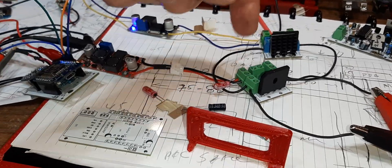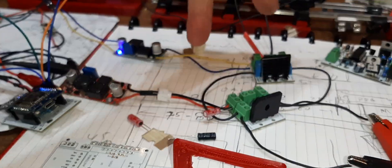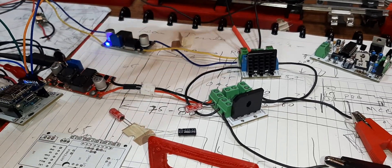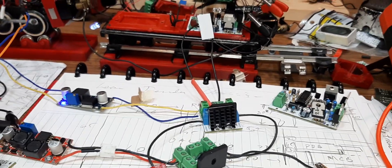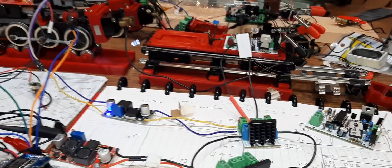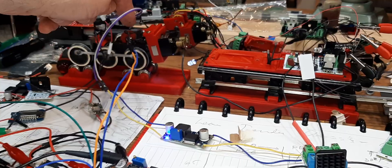The vertical board won't have any hooks — it'll just be hardwired in. Maybe have the front one with connectors so you can unhook it; it's only going to have about four connections. All the track power will have to go into one board and then share, so that'll require a little extension in the wiring for the track pickup. I want all-wheel pickup on this particular model. I think once that's sorted, we're ready — oh, one last thing I need to check.